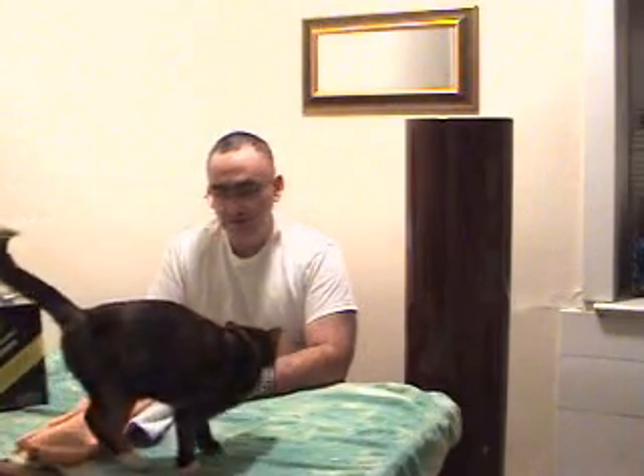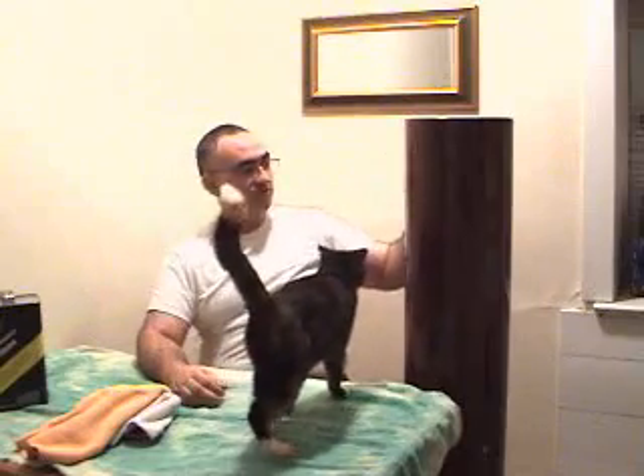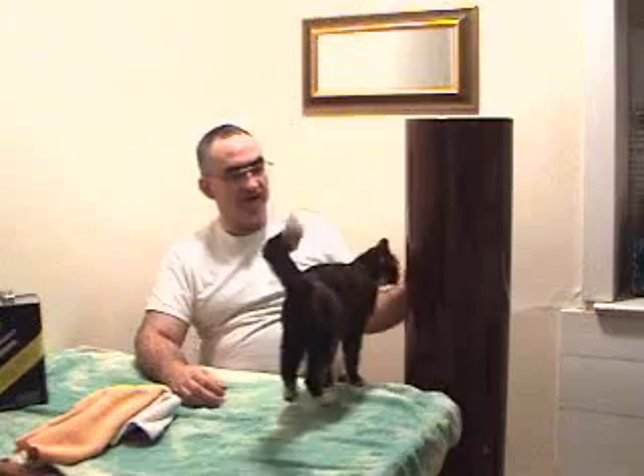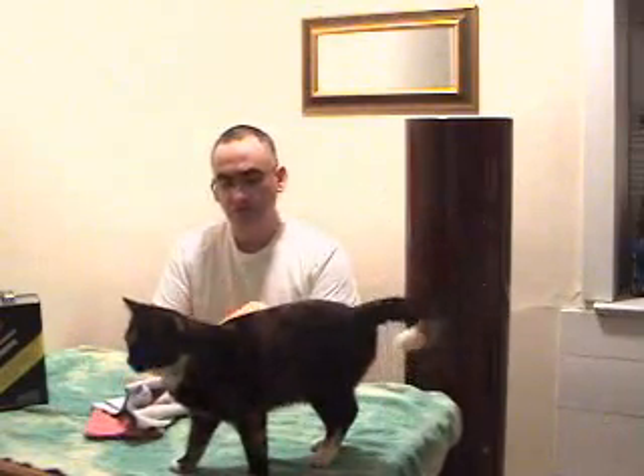Actually, I'm not a beginner, but this is the first time I've used an experimental tube. I wanted my tube to be a deep, luscious, rich, full maroon. I brought it to a powder coater to have it coated. Originally they thought they were going to sandblast the tube and then coat it, but after consideration they took a much more labor-intensive approach — they Scotch-Brited the entire exterior of the tube very, very thoroughly. Once it was thoroughly Scotch-Brited, they washed it down with acetone three times until the rag they used came up clean.